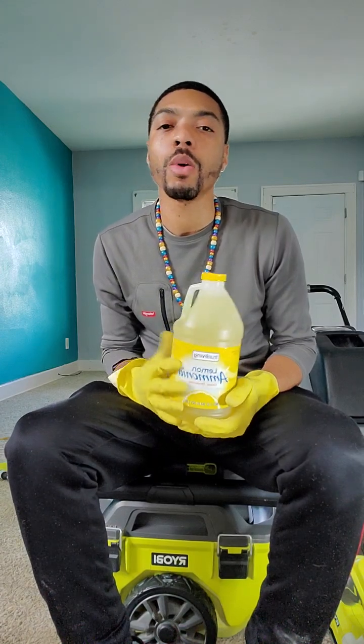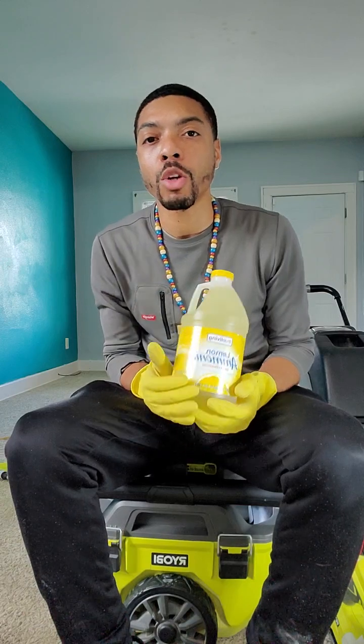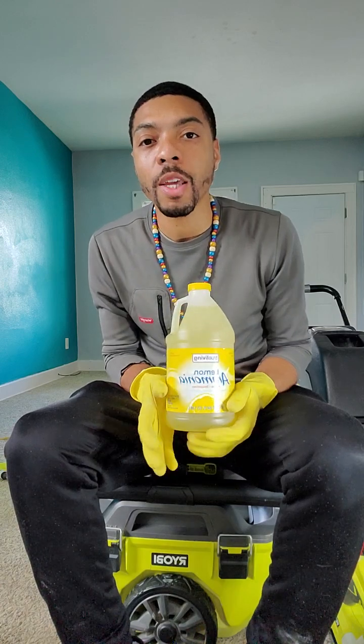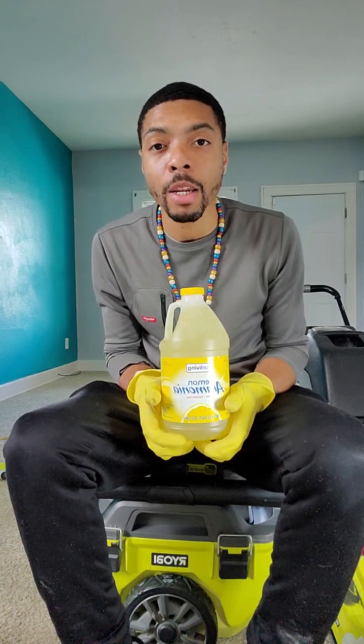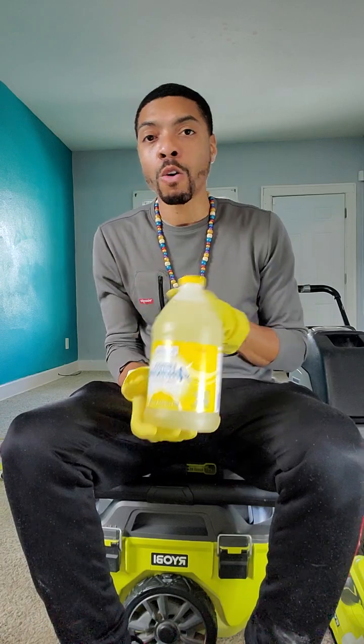Oh, ammonia is good for treating dirt stains and stuff like that, because it evaporates and turns into water. You won't leave soap behind in the carpet by using ammonia. That's the reason I'm using it. It evaporates and turns into water. If you've got a wool rug or something like that, don't do any of what I'm saying. There are other ways to do that. But if you just have regular brown rental property carpet, man, look, run that ammonia.